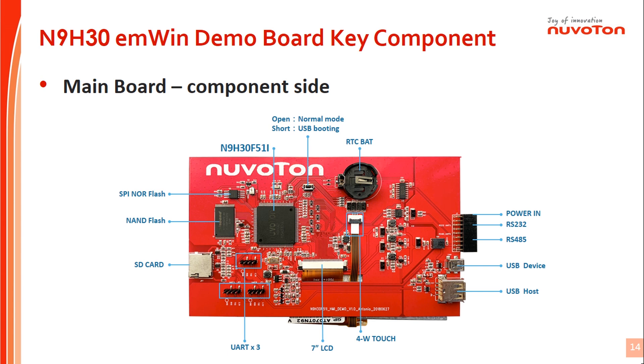The 128MB NAND flash and 2MB SPI NOR flash are Winbond flash products. TTL UART0, UART3, and UART8 can be connected with external devices via pin headers individually. The RS-232 transceiver with UART2 and RS-485 transceiver with UART6 are connected to the power supply daughter board. One USB device port is for PC communication and the other USB host port is for dongle device connectivity. SD memory card access with TF card slot is available. A 7-inch LCD module with 4-wire resistive touch panel is supported. The CR-2032 battery slot is for RTC power backup.